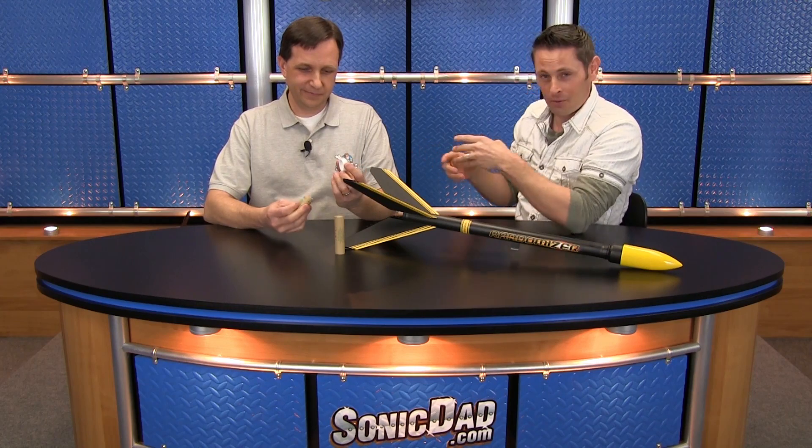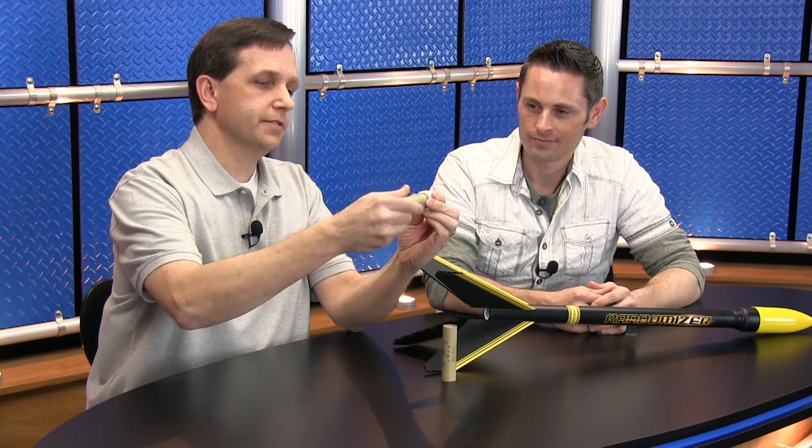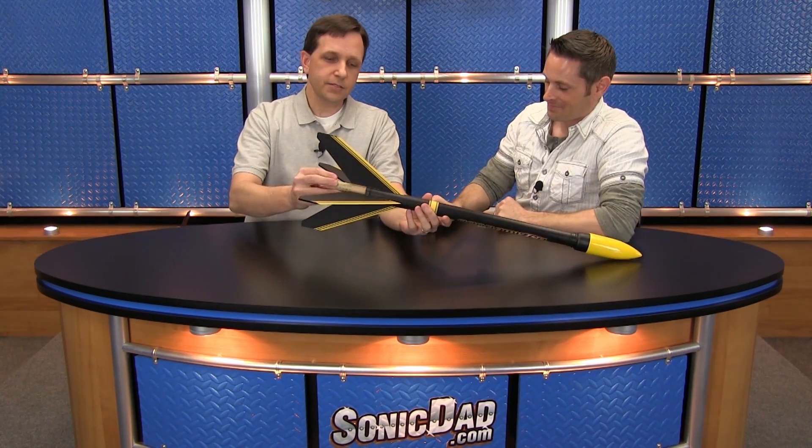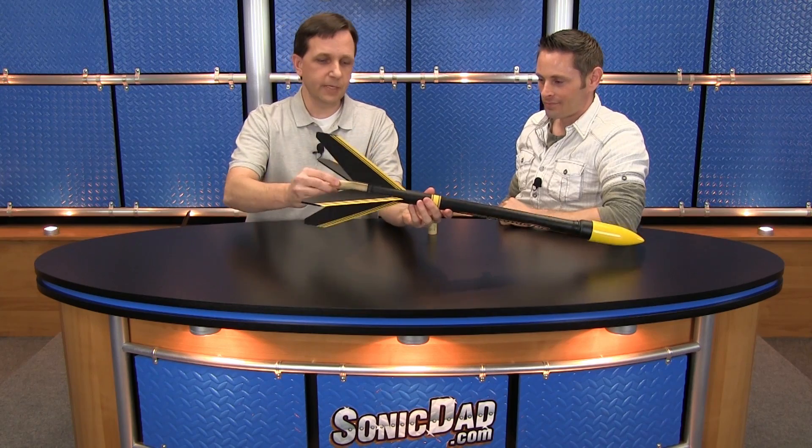I think this is super cool. But how do we get something simpler? It's definitely simpler — about as simple as it gets. It's a lot lighter. This is just a section of the coupling cut off. The whole coupling weighs about 25 grams and just this little bit is about five grams. Grant figured out that you could just thread a normal Estes motor right into that tapered three-quarter inch thread, which is really cool — and that couldn't be a more perfect fit. That is airtight. We've got a lot of launches on this. You just thread your motor in the back like that, so it holds it secure during the thrust portion of the flight and also the parachute ejection.